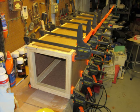Once the Gorilla Glue has set and the clamps are removed, you just want to inspect it briefly. This photo shows how the glue foams out of the gaps just a little bit. If you've put the right amount of glue on, you should get just about this. You want to have some coming out, but not a lot. With the first two panels inlaid and glued, the second two are put in the same way, and once again, the clamps are used as shown.